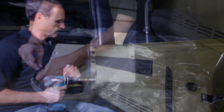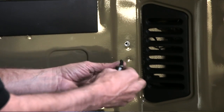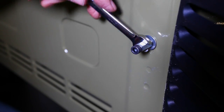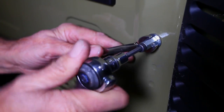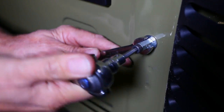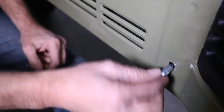Next up we'll put in our nutserts. The nutserts are just threaded onto the bolts that we'll be using to hold it all together. Put the nutsert into the hole — you might have to tap them in a little bit. You want them good and tight. Thread in the bolt and it'll go clear into the nutsert. This is where our 10 millimeter end wrench and five millimeter Allen come in. Keep pressure on it and just pull it in — it's going to crush the nutsert and expand it out into the metal, giving us a place to run our bolts to hang the shelf. You'll feel it start to tighten up as it crushes out and gets nice and solid. Just back it out and you're ready for the next one.